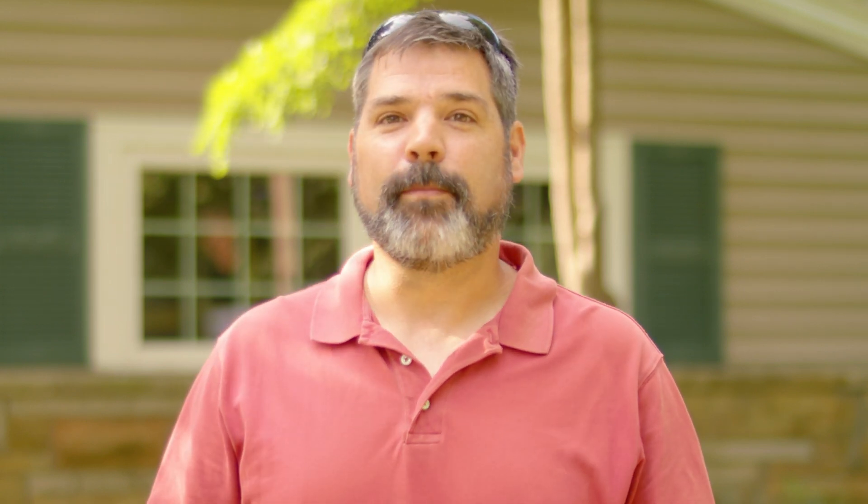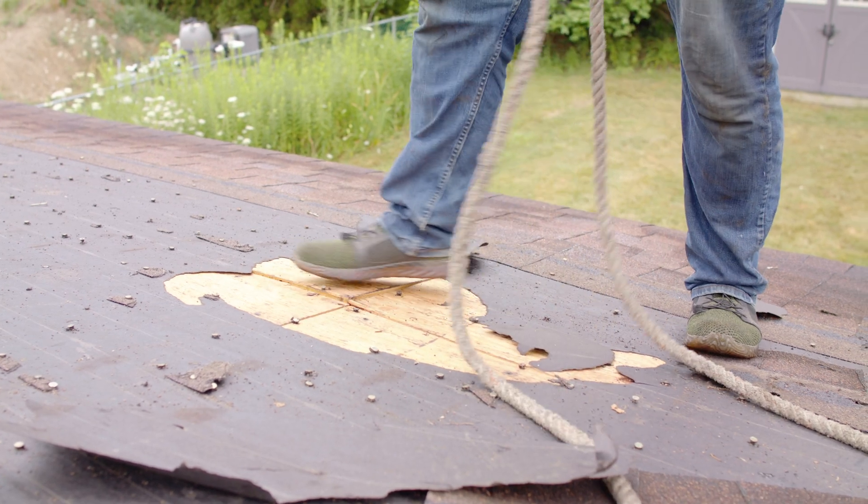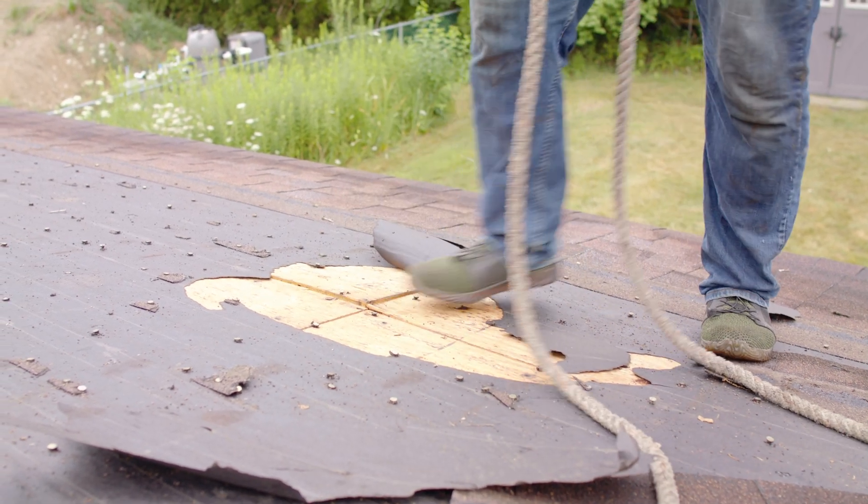On Adam's house, we did come across loose nails. The plywood in some areas was just butted too tight together. When the plywood needed to expand, the corners were running into each other and the fasteners were loosening up. So in some areas of the house we had to make sure the gapping was right and we had to refasten sections of plywood.